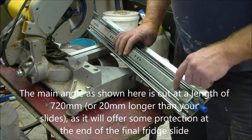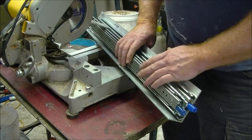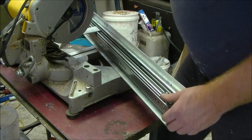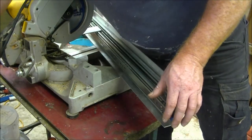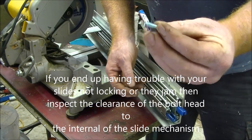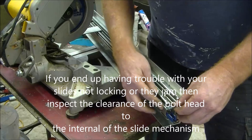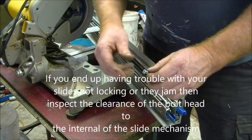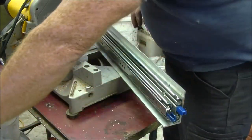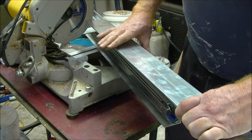It's fairly straightforward — cut to size and drill your holes. I'm not going to give you measurements for the holes because they'll have to be relevant to the brand and style of slide you buy. For the bolts to hold it together, I'm using a round head M6 bolt. The reason I'm using a round head is that when it goes inside the track, there are little levers that go up and down and it runs smoothly over those. The next step is to cut the table length which will hold the first part — the fridge.